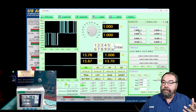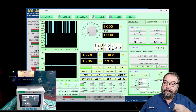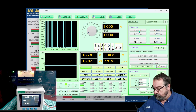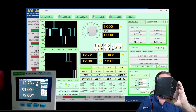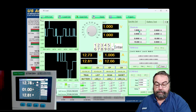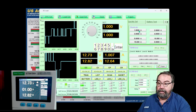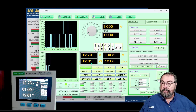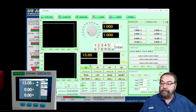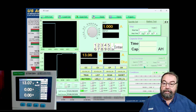The other test we're going to do is a battery test. I have a Mieti battery hooked up to our load — this is a 16 amp hour LiFePO4 battery I've used previously and know works fine. We're going to turn off constant current and flip to the battery test, which changes the parameters over here.